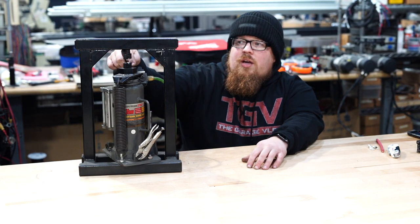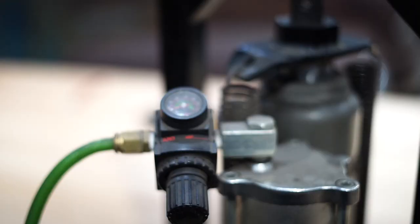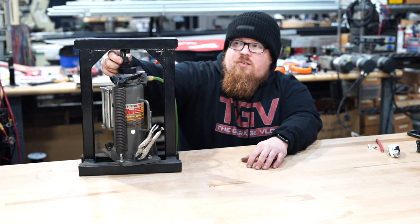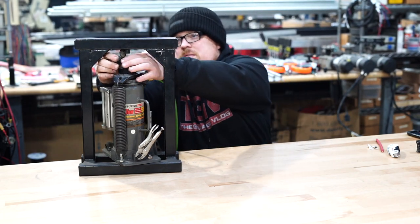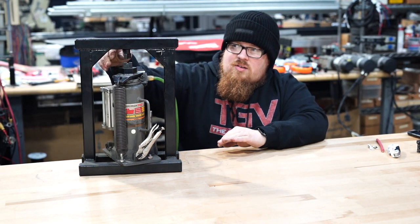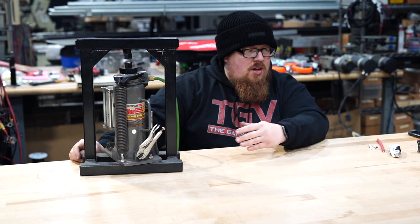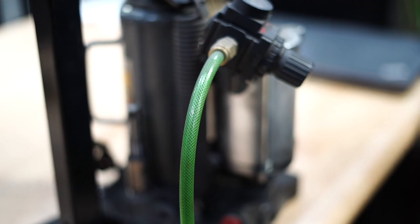I got the cylinder itself and welded a piece of hex onto the top, then drilled a hole in it the same size as the dies, so the dies slip right in. On the top, lined up perfectly, is another die that also has a hole and slips right up in. I have a rare earth magnet that sits here and holds the upper die from falling down, which makes it quick and easy to change the dies. There's a whole bunch that come with the Harbor Freight tool.